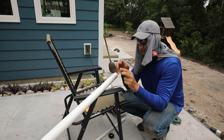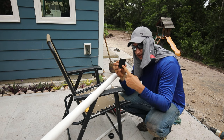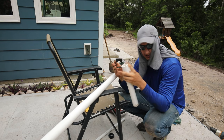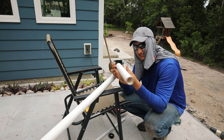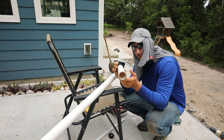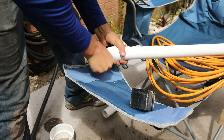This drain kit comes with little end caps that go on the end of the channel drain, and it has a little knockout in it. Since I'm going to attach my pipe I went ahead and knocked it out and will put a small piece of pipe in. It just sits in there loose — it's one thing I don't really like about this design, but the literature doesn't say otherwise. Then I'll have my 45-degree fitting on this side that will go to the other pipe.